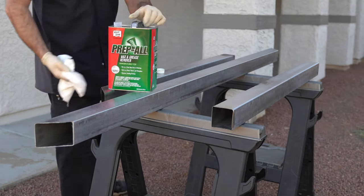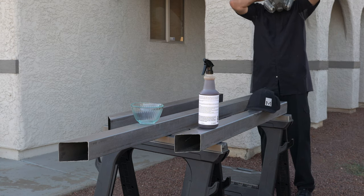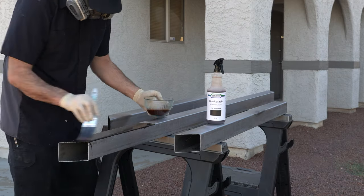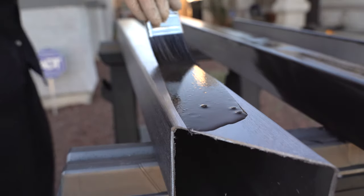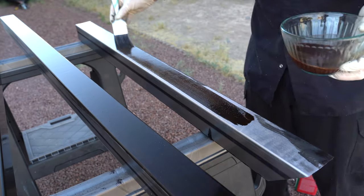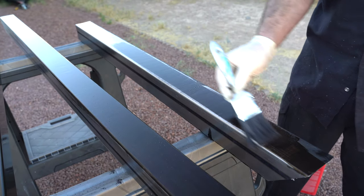The instructions say scuffing the metal first may improve the performance of the product — I think we're scuffed. Next is removing dirt and oil from the surface. Sculpt Nouveau makes their own degreaser but I already have some I use before prepping for paint. Lastly, put on a vapor respirator and some gloves. They make it pretty clear this stuff is harmful to drink or breathe in and it smells terrible. There are several ways to apply this stuff — it comes in a spray bottle, you can blot with a sponge, soak smaller pieces, or brush it on. I'm going with the brush method, which I will apply in the same direction as the wood grain. I think brush strokes will either be hidden by the scratches or enhance them, and I'd like to waste less product by avoiding overspray because 50 freaking dollars.